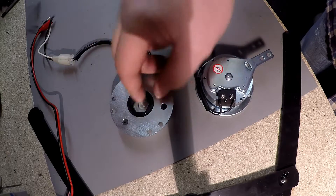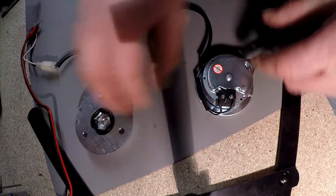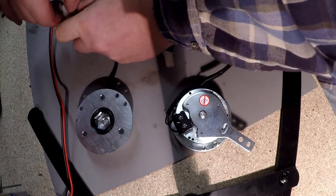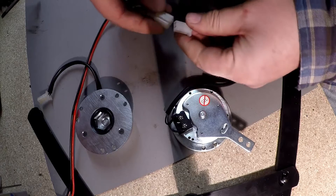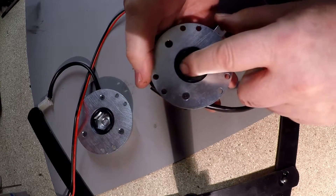So that's how you test it — put it on, it's spinning around, should be okay. Now, everything else works exactly the same as the one with the micro switch. You apply the voltage — 24 volts — you hear the click and it's in freewheel.